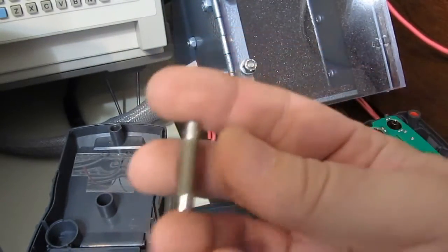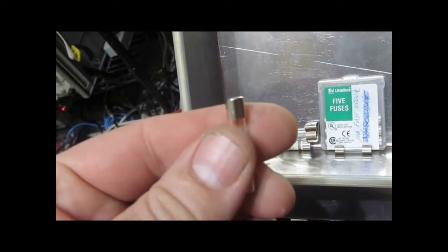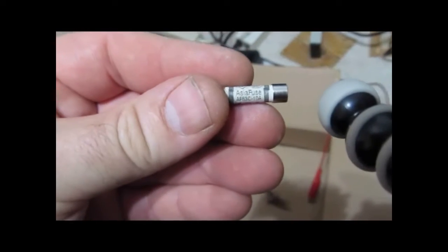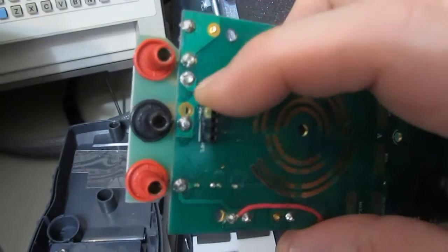If you watched my video where I damage these fuses, these are actually filled with sand and it'll quench the arc — that's very important. We want to get that arc suppressed as soon as possible. This is a 5 amp glass fuse with a UL listing on it. We'll install these into a couple of clips. This is from Asia Fuse — this is a 10 amp ceramic fuse. That's why you want to use ceramic fuses inside your multimeter. On a spark gap like this, that's not going to happen — this is going to continue to erode and there's nothing that's going to break that arc.